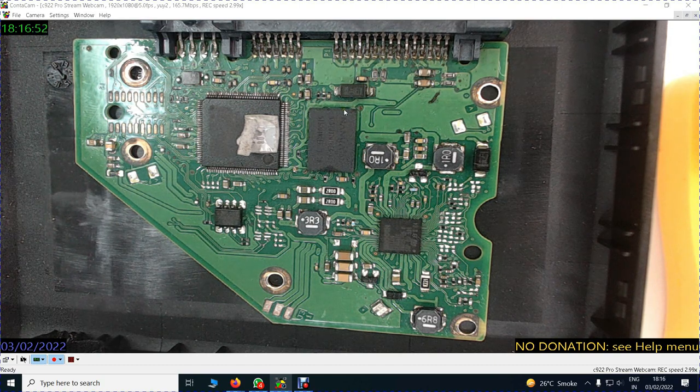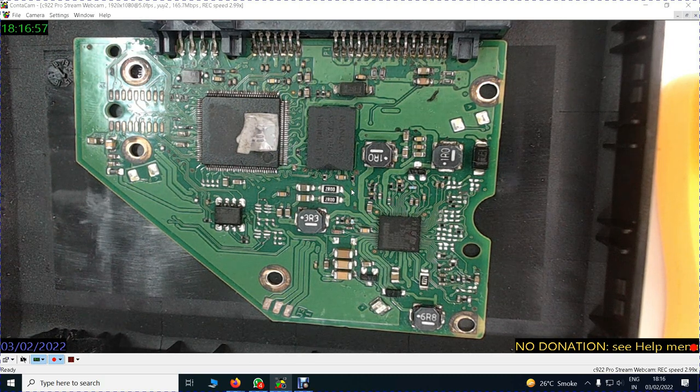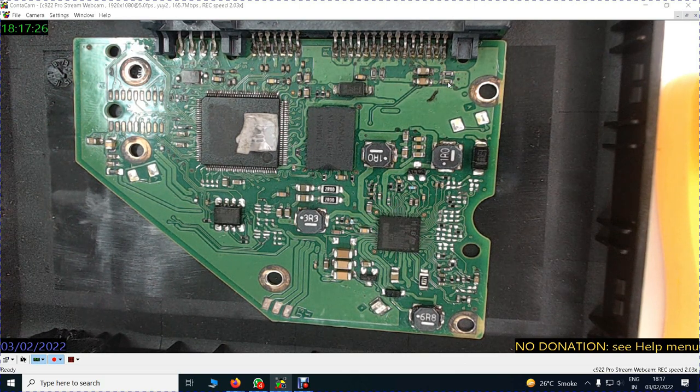Also faults. When you see that a board is dead, why is it dead? It is dead because of the power supply from here and here, this is 12 volt. From here it is going through this component and going this side. Again, this and this component are connected and it is going this side. So the 12 volt here is going this side through a fuse line. This is a fuse line. In magnification view, you will find three zeros on this fuse line.